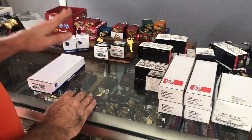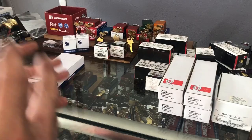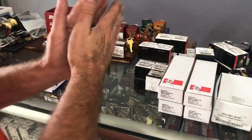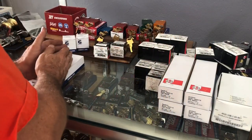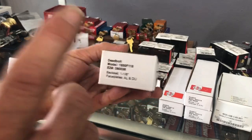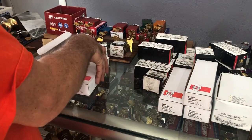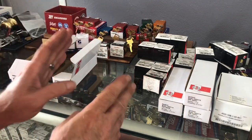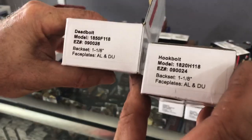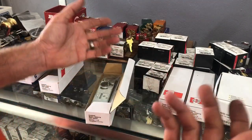There are three different versions and three different backset measurements. There's 31/32-inch — an older style you rarely see anymore — inch and an eighth, which is by far the most common, and inch and a half. If you're going to stock anything as a locksmith, stock the inch and an eighth. Those come as deadbolts or hook bolts — essentially the same thing, except hook bolts have a hook.